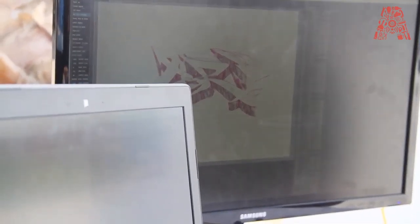How all of this came together is that we wanted to draw the art using the PolarGraph software. We take a picture, map the coordinates of the picture based on X and Y axis on our canvas. The PolarGraph software uses these coordinates and sends them to Arduino. The Arduino, acting as a microcontroller for the whole project, controls two servo motors that have the pen connected to them. It basically moves the pen according to the coordinates it's receiving from the PolarGraph software.